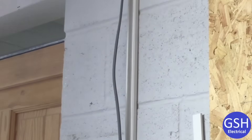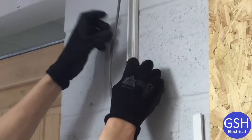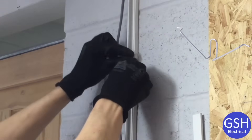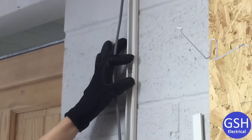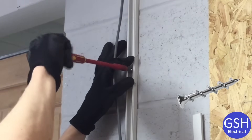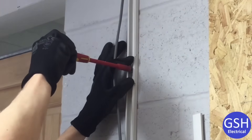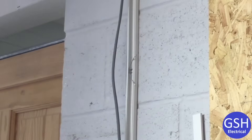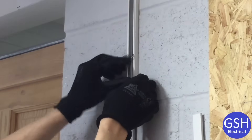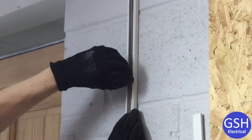That's our 5mm hole drilled with no problem. Now we'll insert the clip into the trunking — I've just pulled the wire out of the way temporarily. These simply clip into the trunking quite easily. If you leave the clip just hanging over the side, that makes it a lot easier to get your cable put behind it. Then using the wall dog screw, we screw that directly into the fabric of the building. Just nip that up — you don't want to over-tighten and strip out the fabric. Then it's simply a matter of pulling the cable behind the clip gently, making sure you avoid any nicks and scrapes to the cable surface, and the clip goes inside the trunking.